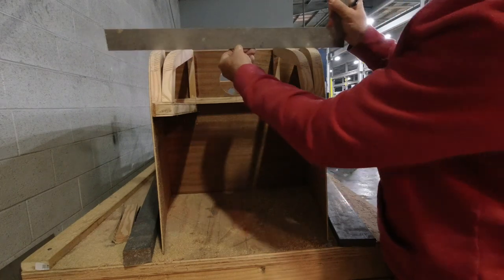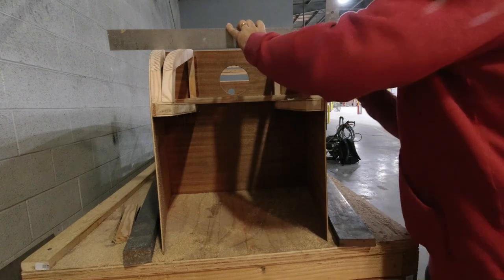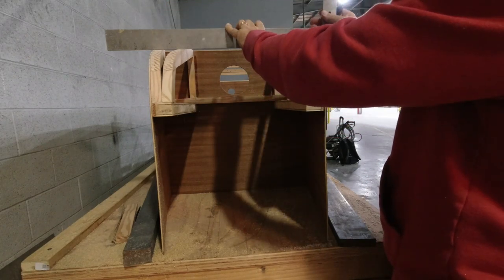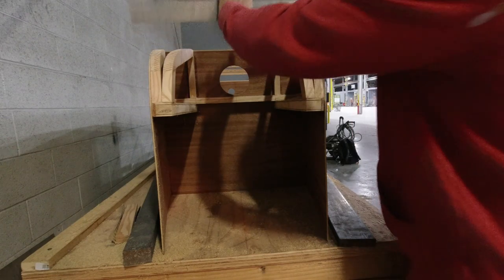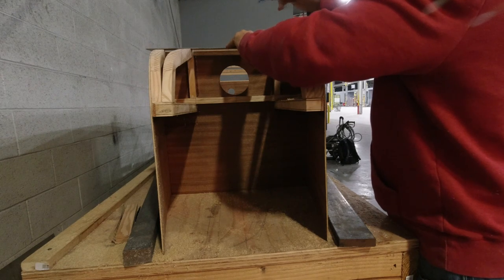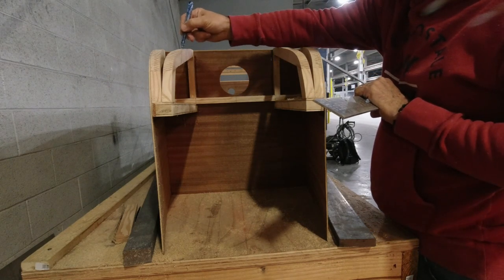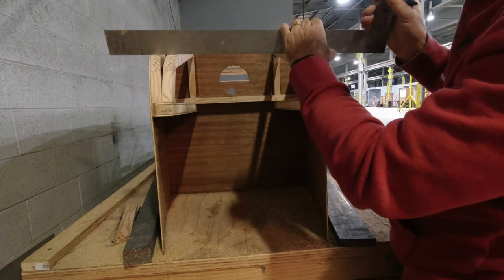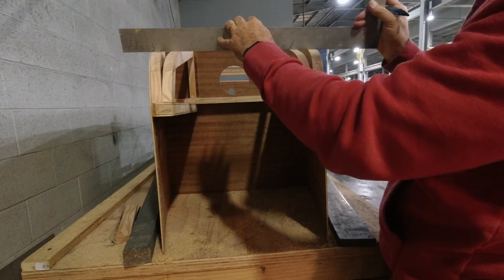So what I'm going to do is mark the spot where they're equal, which is about there. So there they're all pretty much the same, and then they transition where this one is slightly higher. Not right there, it kind of starts about here. So this section here has got to come down, and this section here has got to come down. And then it transitions, and then out here we're just the opposite, so that side is closer.